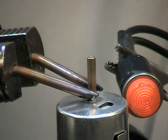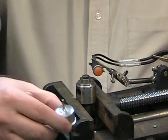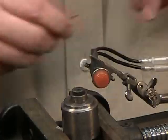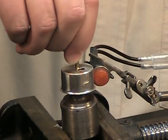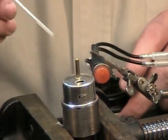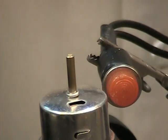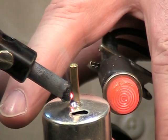The run light shows the actual dwell time required to melt and flow the solder. For the next demonstration, we will use a single electrode probe style system. This requires the use of a current return harness which can be attached directly to the conductive soldering fixture as shown. The brass pin is cleaned and inserted into the metal cap, and the assembly is placed onto the soldering fixture. A small amount of flux paste is applied to the intended solder joint area and the preformed solder ring is put into place. The carbon electrode has also been customized to better match the contact surface of the brass pin. Again, the run light shows the actual dwell time required to melt and flow the solder.